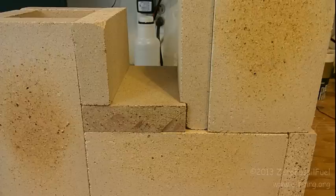You'll see how it fits together in this next photo: the brick that was offset in that first picture of the J-tube now sits down flush. The top edge of this brick is now flush with the rest of the vertical bricks that start the flue stack in the center. The overlap just sits on top of the brick that lays across the top of the horizontal burn tunnel.